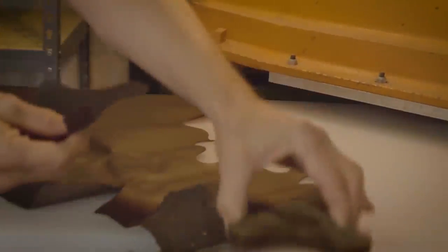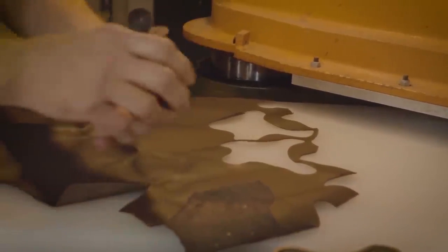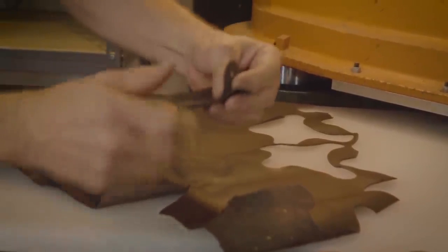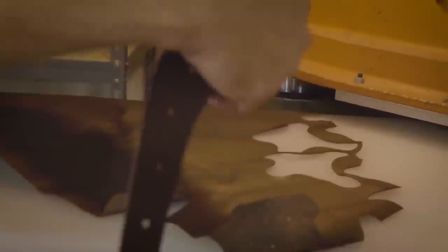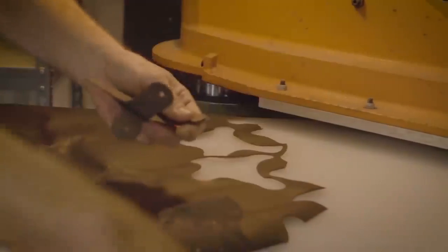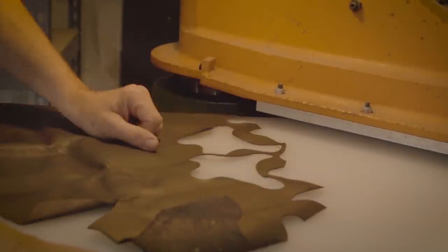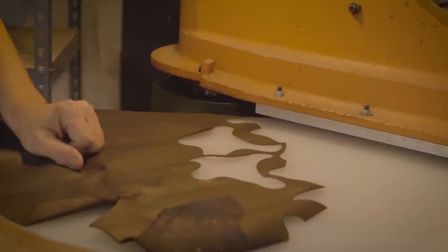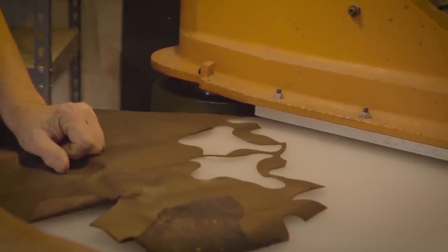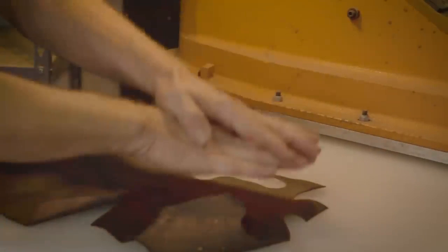These butterfly pieces for the harness, you need to cut two of those, as it creates a front and a back to capture the strap in between. And when you're clicking, you jigsaw the shapes together as closely as possible to waste minimal amount of material. That's another nice thing about the die cutting, is you can place them very closely as all the force is coming down directly from above.